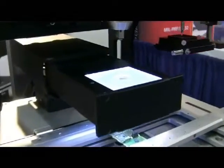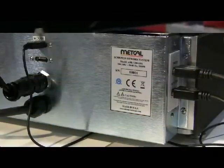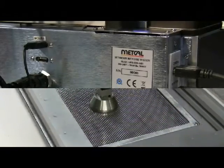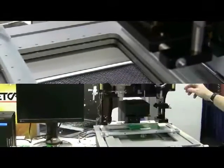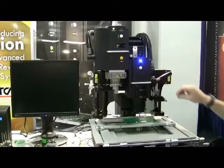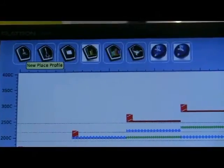The Scorpion is self-contained, making it a compact benchtop system. The onboard controller eliminates clutter and requires only four wired connections for fast and easy setup. The open-ended board holder fits a wide variety of large, small, and odd-shaped boards and allows precise positioning over the patented dual subzone preheater.